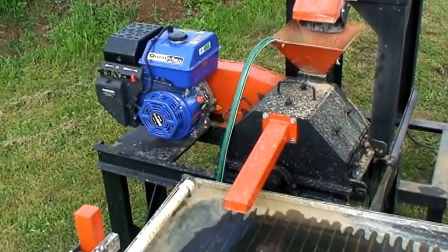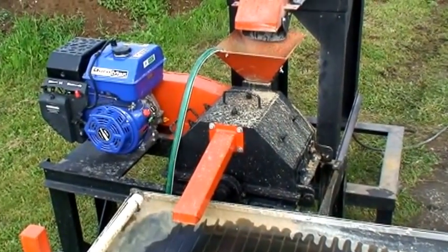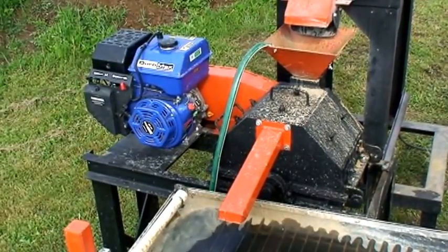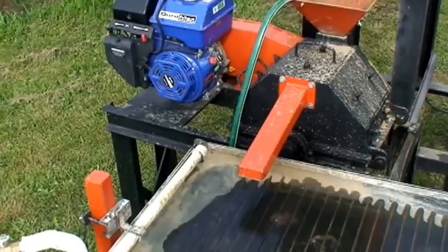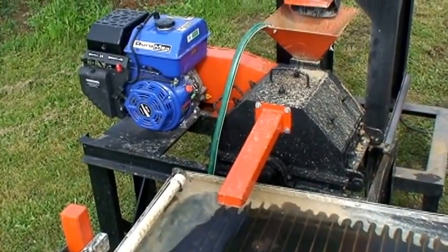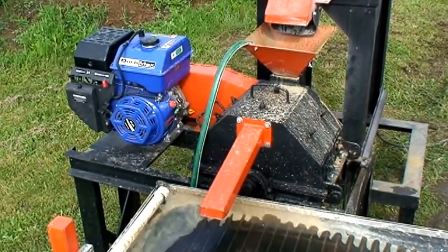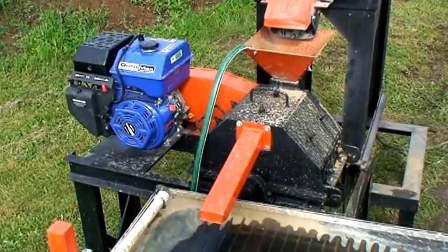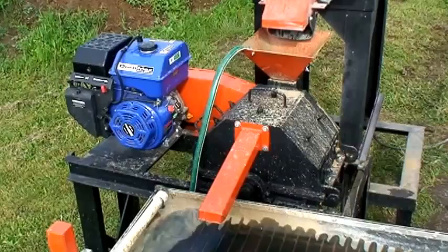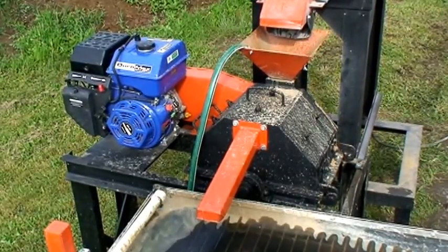This is our impact mill. It's run with a 16 horse gas motor. The discharge feed out of the jaw crusher goes right into the orange hopper. This machine can take up to one inch feed and it discharges out of the shoe down to the shaker table. It can keep up with the jaw crusher at a thousand to two thousand pounds an hour. It discharges 20 mesh minus, and our screen sieve analysis determined that 50 percent passes a 50 mesh screen on the first pass. You can recirculate the oversized back into the impact mill for finer crushing.